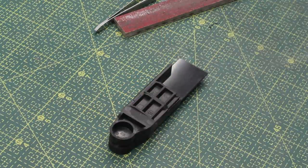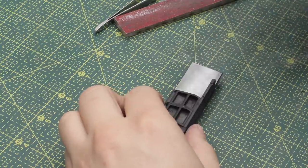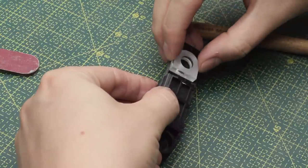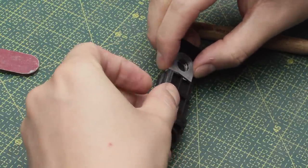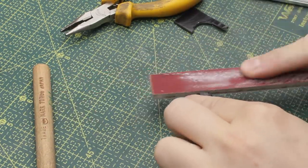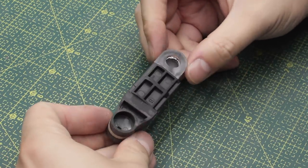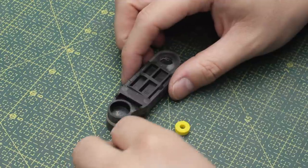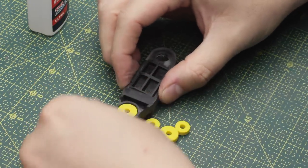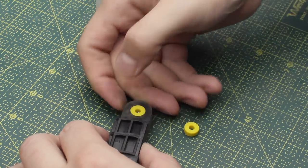Once I had each pair glued to each side of the leg piece, I just had to trim the excess of the top piece with my Dremel. And now I'll just glue a couple of laser-cut acrylic pieces to create the front axle of the intermediate leg piece. Of course there was some extra styrene, so I just had to trim that down and give it some sanding. Now I have the body, the full shape of the intermediate leg piece, and I'm happy with it. The blue temporary piece had a big hole in the axle, so I decided to change that. I feel like an M4 bolt is more than enough for this project, so I printed those yellow pieces to go right in there and create a thinner axle.